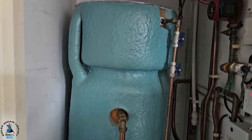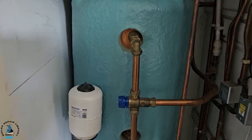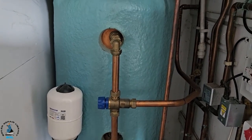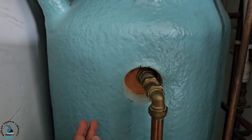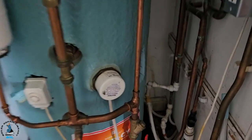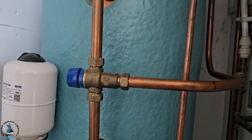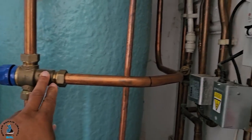This cylinder is a special one because you've got the cold water storage on the top and the hot water underneath. You would think this section here is where the hot water goes to the taps, but it's not — this is a thermal store cylinder. Inside is a coil which is heated indirectly, so the surrounding stored water heats up cold water. Cold water comes in through here, through that strainer, goes into the bottom of the coil, picks up heat from the surrounding storage water, comes out hot, goes through this mixing valve, blends, and then goes out to the taps.